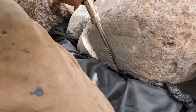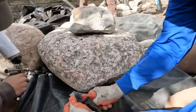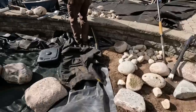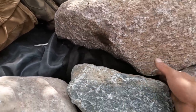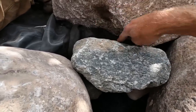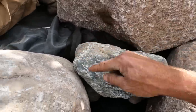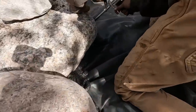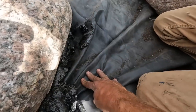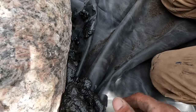A lot happening — Jack is foaming behind the waterfalls, Frank is trimming excess fabric. We want to fill all the void spaces so water is limited from leaking behind the boulders and instead falls over the spillstone. To conserve foam, we cut back the fabric, fill cavities with gravel, foam over the top of the gravel, then lay a bib liner down. This avoids filling the entire cavity with foam, which gets very expensive. It's also critical to compact everything under the liner well — water weight pushing down can break the foam seal.